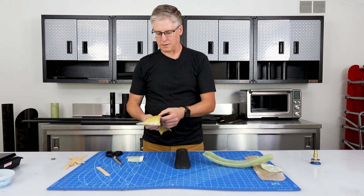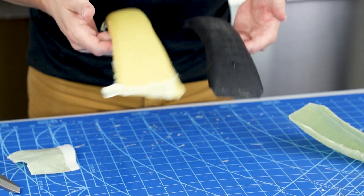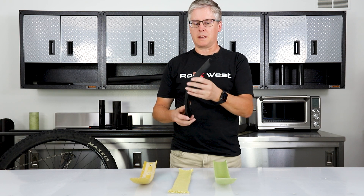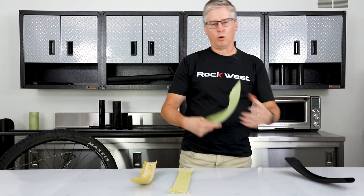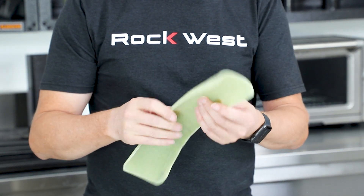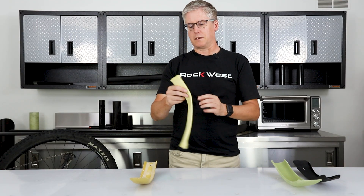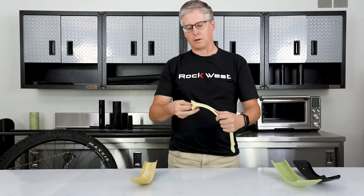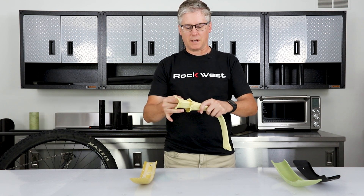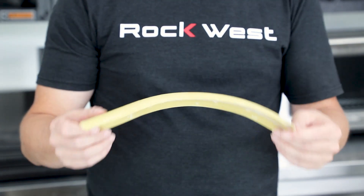Here's the original part and here's the new part — should add a little bling to the bike, probably a little bit lighter too. A little recap on what we've done: we took the original part, cleaned it up, put some tape on it, some release, and made a mold out of it — a very cheap, quick-and-dirty fiberglass epoxy mold. The Kevlar itself — we used the braid with a braid inside another braid to get the layers we wanted, and we can resize it by just stretching it.